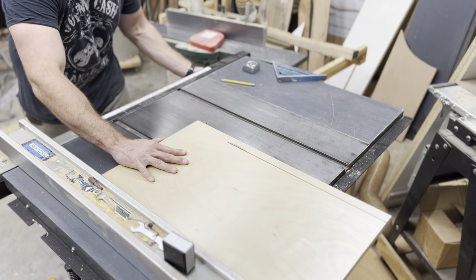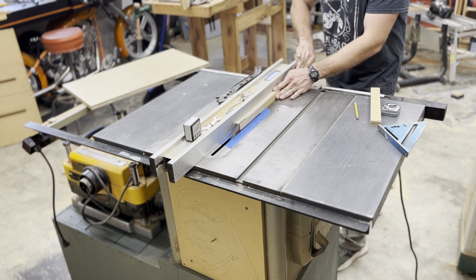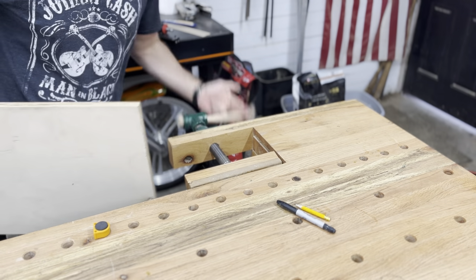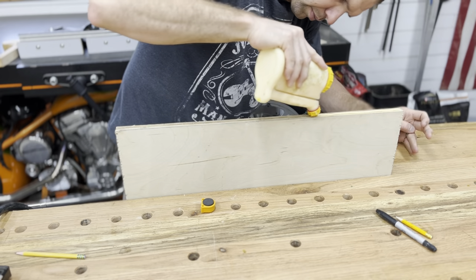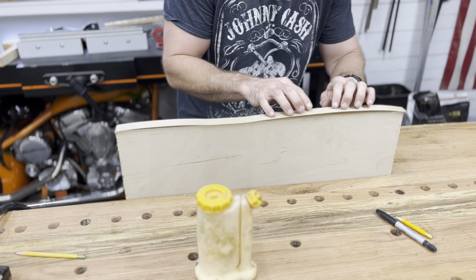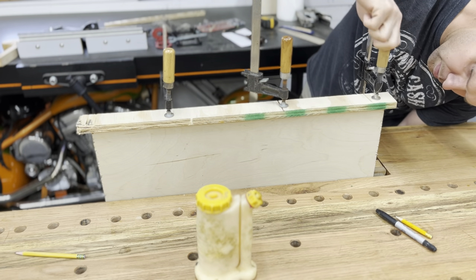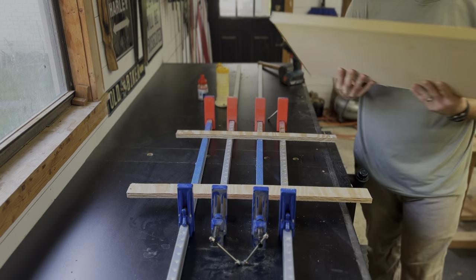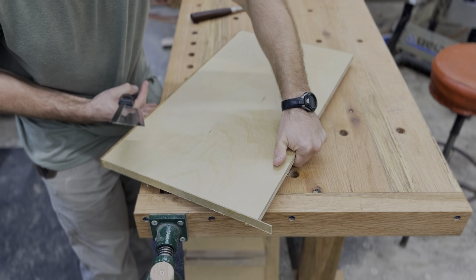To put a face cover over my precision-made drawer, I'm using a piece of maple plywood. Here's hardly a pro tip, but something I accidentally discovered when getting really expensive plywood. That is maple three-quarter inch plywood pre-finished — it runs about $150 a sheet. I got it for $15 a sheet because I got it damaged. If you go to a specialty plywood store — not like a Lowe's or Home Depot, but an actual specialty store where cabinet makers get their plywood — ask for their damaged products, and you can usually get it about 75% to 90% off. I don't have any edge banding, so I just made my own with a piece of cutoff — ran it on my table saw, took the veneer off, glued it on, clamped it on top and bottom, trimmed it off, and it's good to go. It's pre-finished and it's a much prettier piece than the plywood face that was already there.